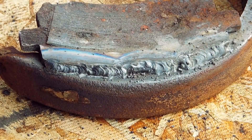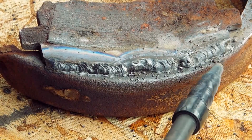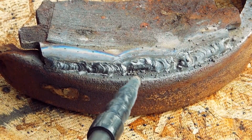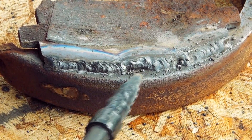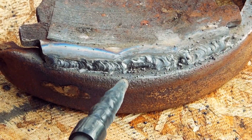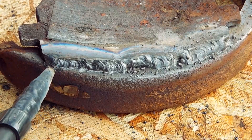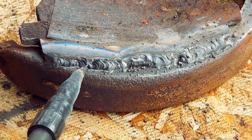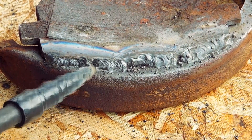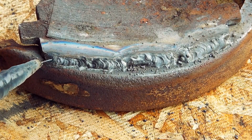There is wire speed setting number six right through here. Here's five. Here's four — it didn't quite stay in the V of the two work pieces very well right here. And then this is wire speed number six right here. Five and six are very similar. I think I went a little slower when using five, and I might have actually moved a little too fast using number six on the wire feed speed.